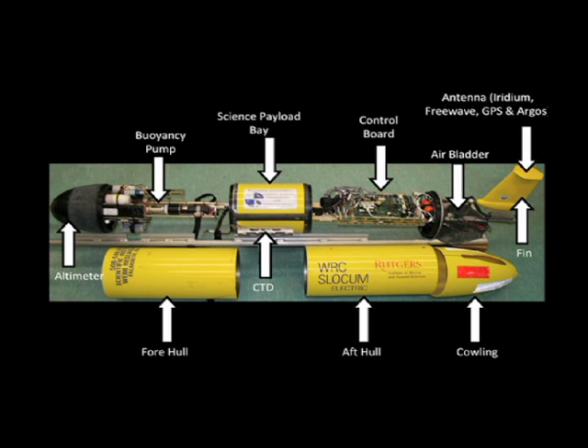All the way in the back of the glider, you'll see where it says fin as well as antenna. This whole system on the glider is called the digi-fin, and the fin is actually what allows the glider to maintain its track and follow a heading and get from point A to point B successfully. The digi-fin also houses all of the antennas that we use to communicate with the glider and for the glider to know where it is. The most important being the iridium antenna — that's the actual communication antenna. It allows the glider to place a rather expensive cell phone call, and then it connects to a large computer in the cool room called Dock Server. Once it's connected there, we can be anywhere in the world talking to these gliders. FreeWave is literally just a free form of talking to the glider. And then you have your GPS and Argos, which are positioning instruments so the glider can know where it is.